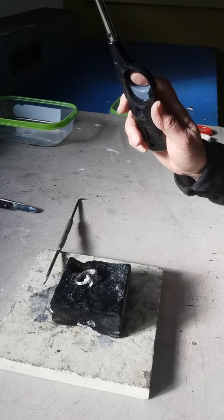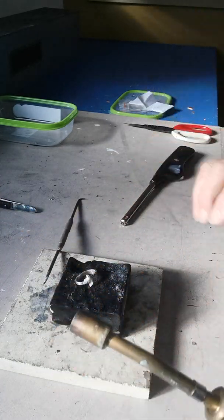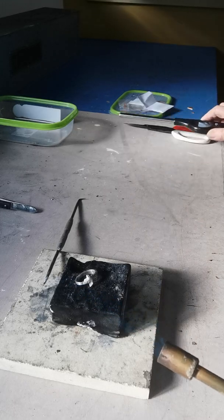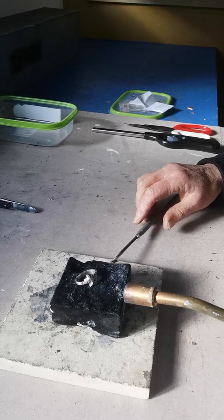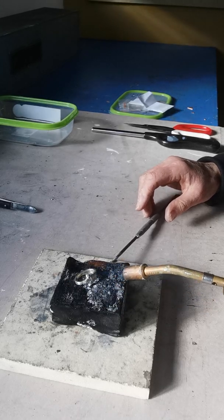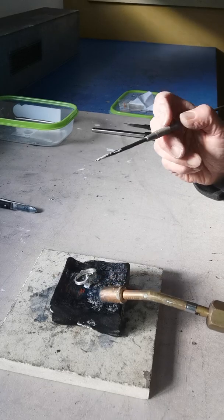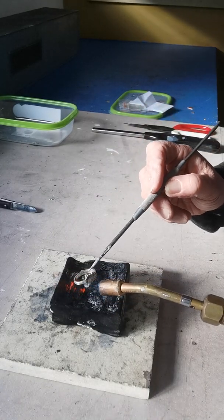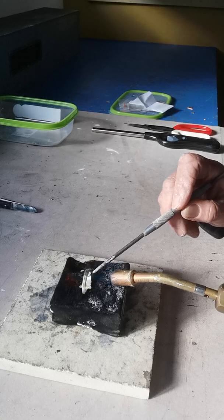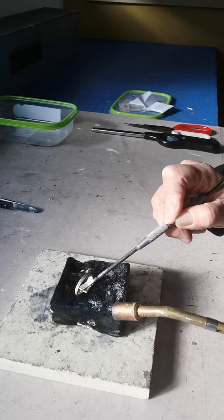The cylinder is on. I always make sure it's turned off beforehand, then I turn on the gas and light it off to the side so I can see the flame. Really important to be set up before you start this job. Just play the flame around the ring — you can see the flux is bubbling, it goes a really dirty colour, but when it's clear you are ready to apply the solder. I just apply it straight to that joint; the whole piece needs to be at the same temperature. I flip it over looking for the solder to flow along that joint on both sides.